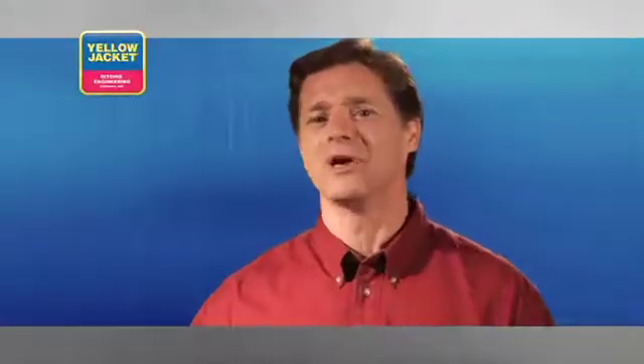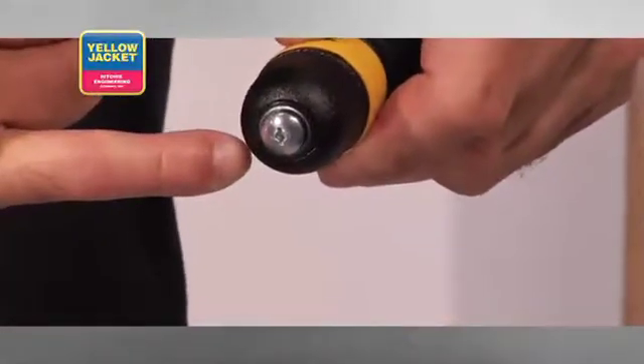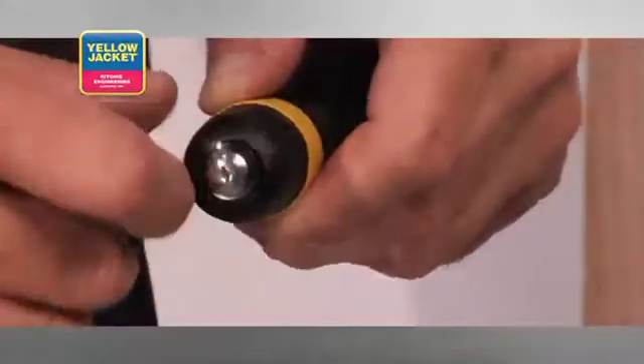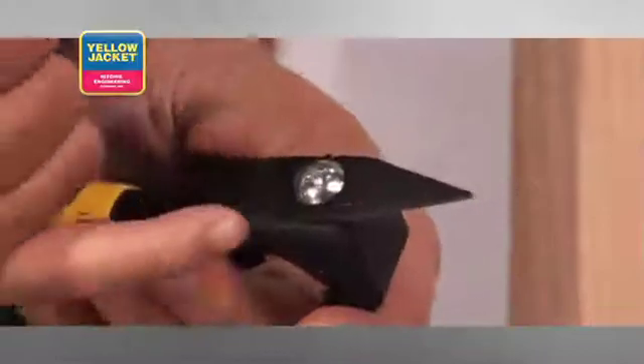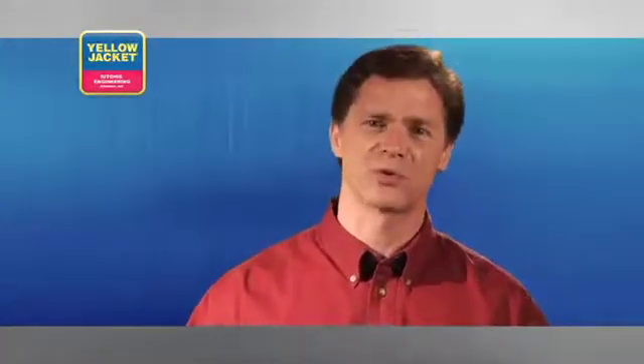As with many of the cutters, the Premium Tube Cutter has a spare cutting wheel tucked away in the handle, so you'll never have to worry about being on the job site without a spare blade. It also comes with a deburring blade, and it can be modified with a blunt wheel to double as a constrictor tool for rolling down or capping off the diameter of your tubing.